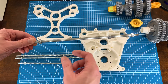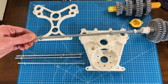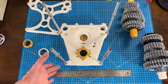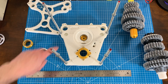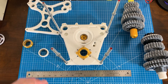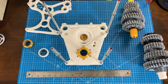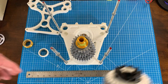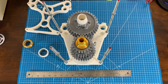Once the spacing is set, I've got a 13mm aluminum tube that I'll slide over the threaded rod and cut to length so I don't need those two nuts — it'll make it look nicer in the final product. I've installed the 8mm threaded rod into the input plate and measured 197mm between the plate and the top of the nut, about a millimeter extra beyond what I need, which I'll fine-tune. The bearings are in, with the plug on the front of the input plate acting as the stop for the front bearing. Note that this is a prototype part — the final part will have four holes; I initially designed it with six but that didn't work out with the reverse gear. I'll go ahead and put in the lay shaft, and then the main shaft, and as you can see they line up perfectly, just like I planned.